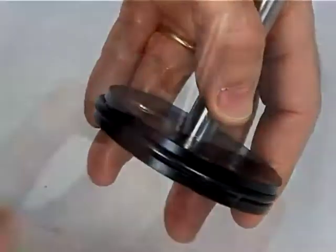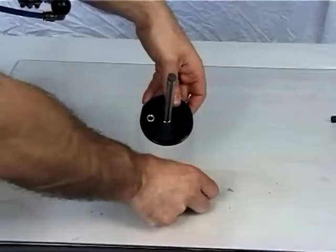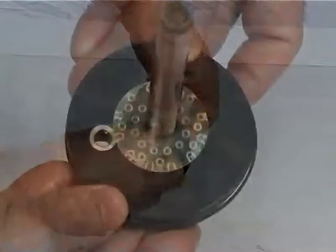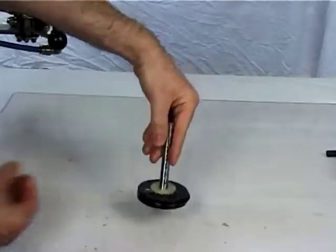Reassemble the pneumatic piston system, checking that the seal, figure 36, moves free on the piston and the dampener is inserted in the right direction. Attention! It is advisable to replace the seal, figure 48, when overhauling the tool.